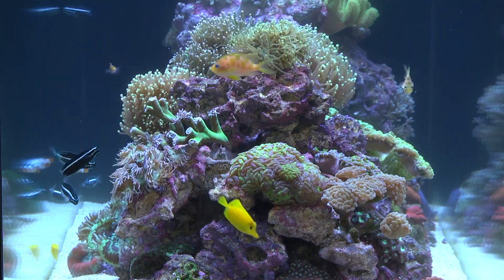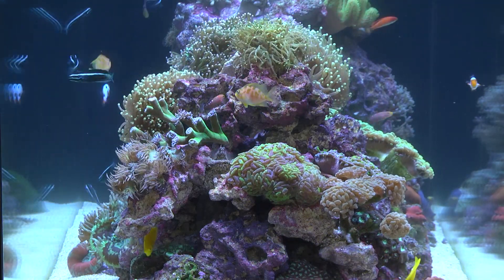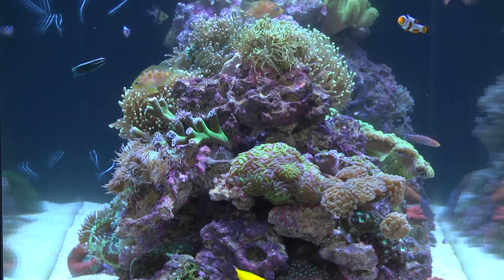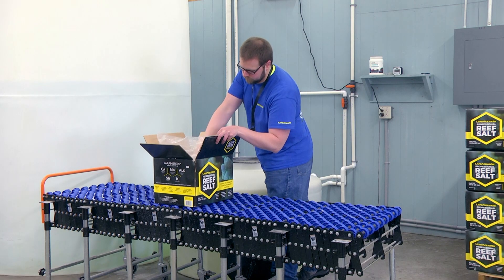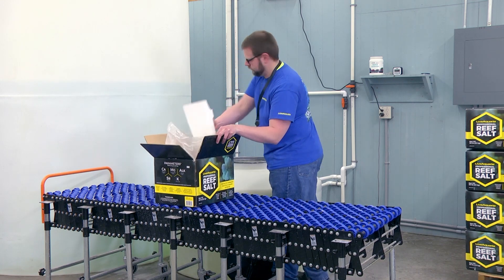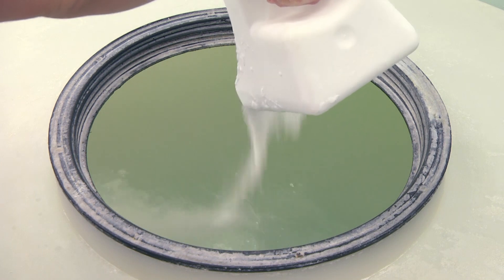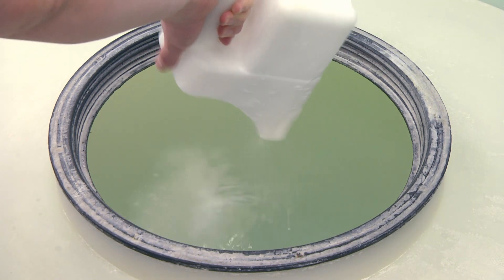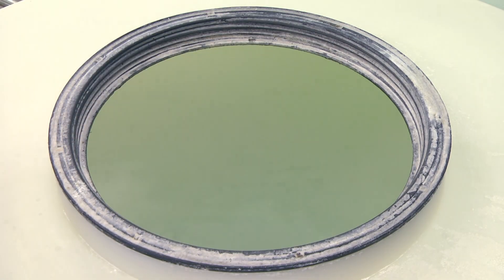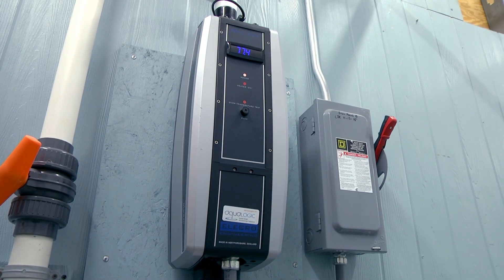Starting with the best water source at home or in a large facility such as this is the single most important factor that can affect the inhabitants in our aquariums. Salt water is mixed throughout the day in our mixing stations. RO water is pumped down into a short mix tank where LiveAquaria Professional Reef Salt mix is added and the mixture is recirculated to dissolve the salt. After a few hours, we pump the mixed seawater through an 8,000 watt heater and up into the salt water storage tanks.